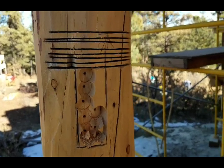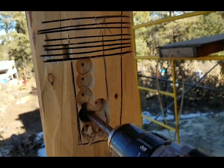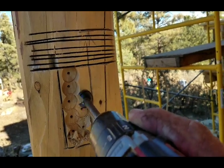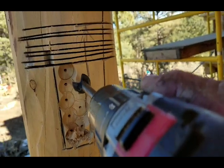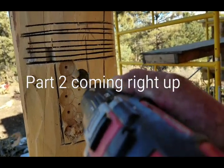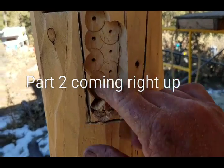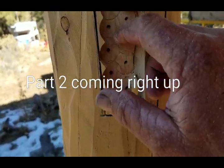I'm just finishing up a few of these bores here. This one I'm going to make a little bit on the deep side so I've got plenty of room to get that piece to slide in there and still have a nice looking joint. Just take your time. It sure saves a heck of a lot of chisel work, but it also gives you a nice flat spot to go back to. When you see the holes there, it's just easy cleaning.